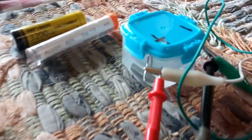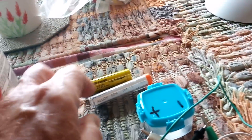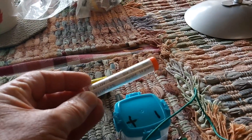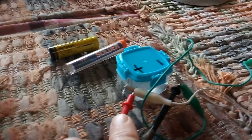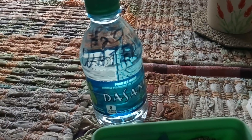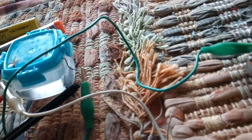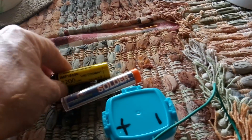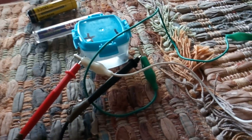So I thought I'd go back in time and build up another one of these solder rechargeable cells. I just happen to have this stuff here — I'm not sure what the exact alloy is, but if you can get a lead solder you can build one of these Epsom salt water and solder rechargeable cells really easily. You have to form the plates by charging and discharging with a three or four volt battery, and after some time the plates build up deposits on each side.